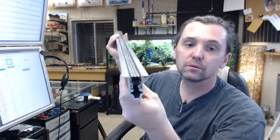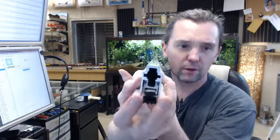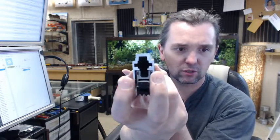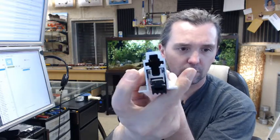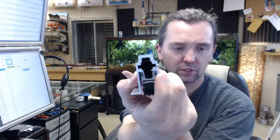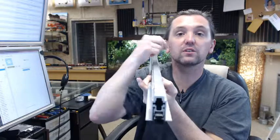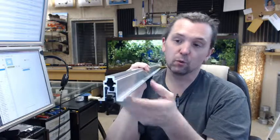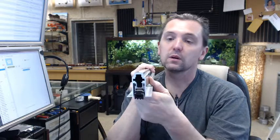It is wide. And holding it upright, you can see right at the very tip of my finger here and here is where that polyfin pile is installed into the keyed or slotted feature of the extrusion on the inside. So elegant solution number one: it only does its job when the door is closed. Otherwise it is tucked up safely inside of its housing.